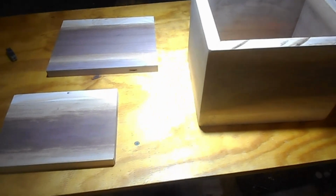Another thing to always remember, it's best when you have this in boards before you actually start cutting it into pieces, to sand your boards down good. If you lightly wet them and wet the grain, it will only raise on you one time. And then sand them while they're still in boards, which is a lot simpler, especially if you're making littler boxes, a lot smaller than this.